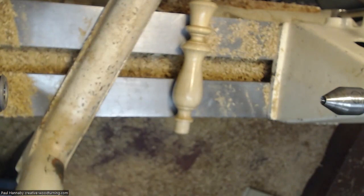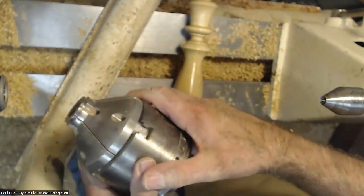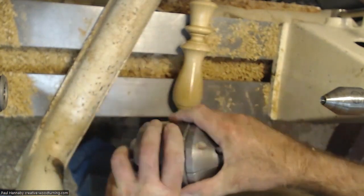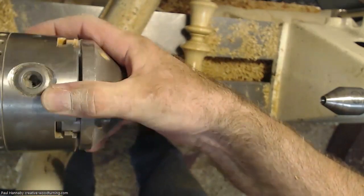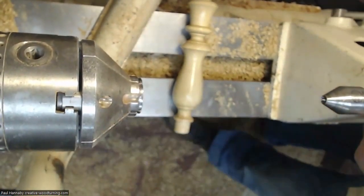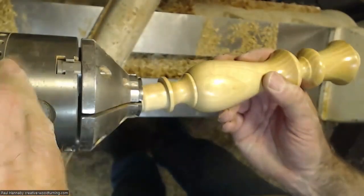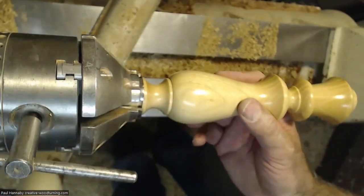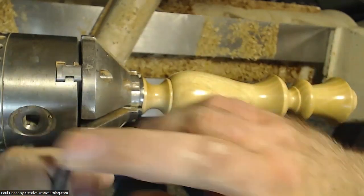Take it home. Okay. So what I'm going to do is put my spindle in a chuck now. Where's the smallest set? That's the one. So I've got a small set of the O'Donnell jaws here, and that centre should hold a 25 mil spindle quite nicely, or an inch spindle. If it does a little bit of damage to it, it's not the end of the world, because that's going to disappear inside the hole. I need to hold that relatively firmly.